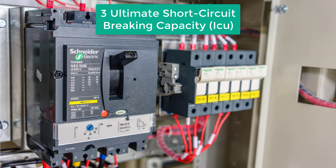Now we move on to the most important factor: the ultimate short circuit breaking capacity. This is defined as the maximum current from a short circuit fault that can be safely cleared twice. It is tested according to the IEC 60947-2 standard, where the MCCB will be reusable after interrupting a short circuit fault. This is however only tested for interrupting two short circuit faults — after that it simply means it has not been tested for more than two times. It's also good to note that a higher ICU rating is an indication of higher quality in a circuit breaker.